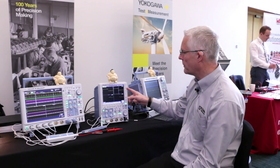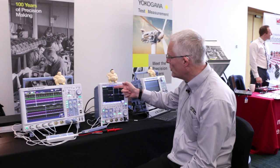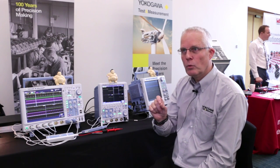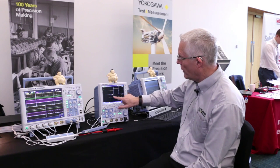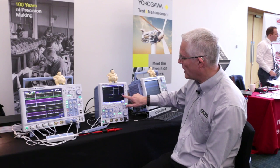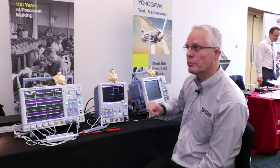You can see the calibration signal here. We've got two zoom windows turned on, and that's a unique capability — we have two independent zoom windows: zoom window one here and zoom window two here. Within each zoom window we've also zoomed in the vertical domain. So now we have the vertical and horizontal zoom in window one here and the same here — here is the top of the waveform and here is the bottom of the waveform.